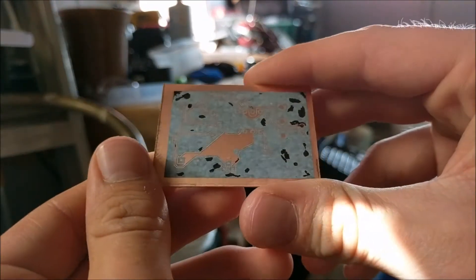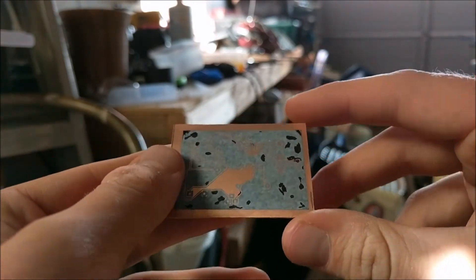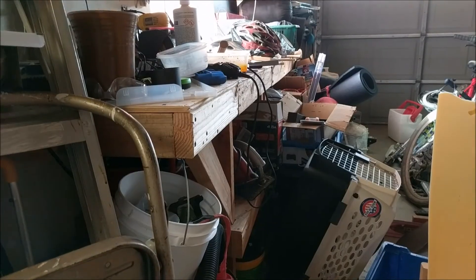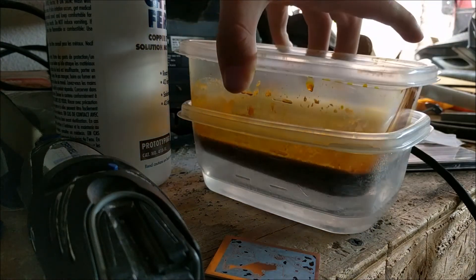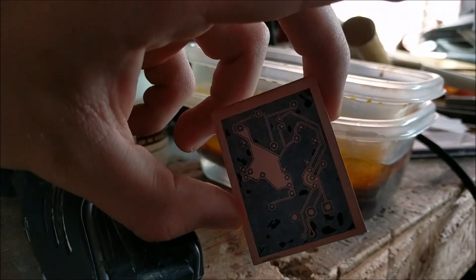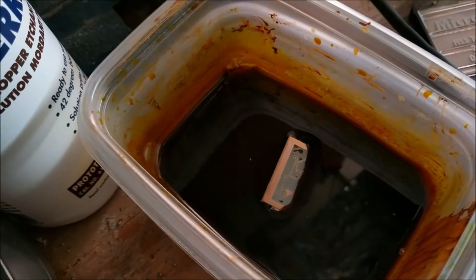Now what I've done with this circuit board is fixed a few little issues with some Sharpie marker, because there are some places where the toner didn't completely transfer — I don't think I left the iron on it long enough. Anyway, it looks pretty good, so we're going to ferric chloride etch away all the shiny copper that's showing, leaving just all the black stuff. I'm going to take a little container full of steaming water — I've just microwaved it for about a minute and a half. When I put the ferric chloride inside there, the water will surround it and heat it up, making the reaction go faster. I can then take the circuit board that has been toner transferred and drop it in the ferric chloride solution. This will etch away all of the copper that's not covered in toner.